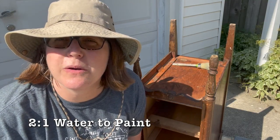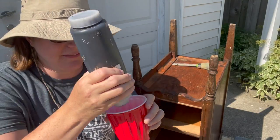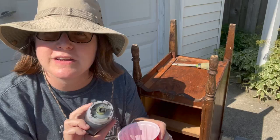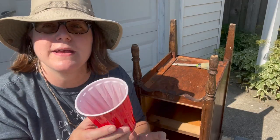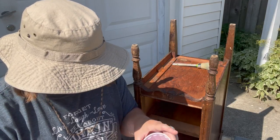Just like you've heard of whitewash, we're doing a black wash. I'm using DIY Paint mixed with water — usually about two parts water to one part paint. With DIY Paint, which is so heavily pigmented, you can water it down almost ten times and still have amazing color. I like to use this wash because it allows some of the wood to show through. I'm using a little black dress color, just eyeballing it. When you make a wash you don't need much paint — that's another great thing about using a wash. You can use it to stain wood in any DIY Paint color. If you're doing it for the first time, I recommend starting at 50/50 and going from there.